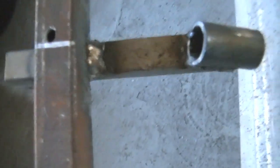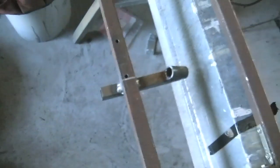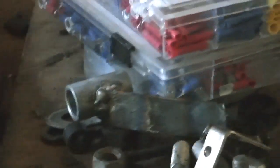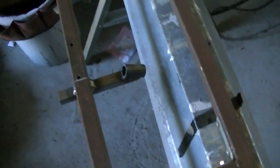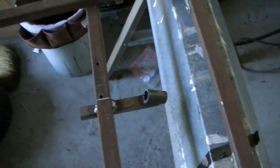The lower ring mount is welded in place. I used a piece of three-quarter inch box steel for that. Originally I wanted to use a different ring mount, but it was too narrow on the inside — barely too narrow, so it was scratching. I cut that off, and that little piece of metal was too wobbly, so I cut that off too, put this piece on, and decided to use these instead since they're a little bit looser on the inside.